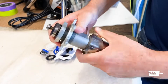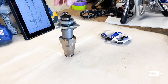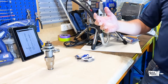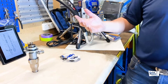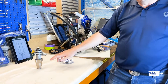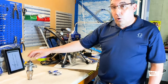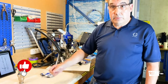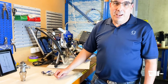The inlet assembly has quite a high torque rating which can be found in the manual. Once the pump's been rebuilt, we would usually put it on a machine, run the machine up to pressure, and check that the pump has been rebuilt correctly by seeing it sit at around 3,000 psi for a minute or two. If the pump changes over, that means there is some bypass of material in the pump, which could mean either the preload on the packings is out, or possibly the cylinder, piston, or rod may be worn and need replacement. If that's the case, we disassemble, replace those parts, and repeat the process.